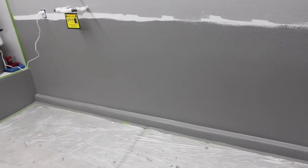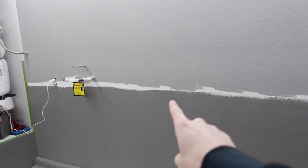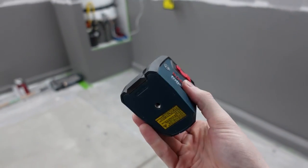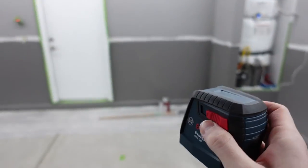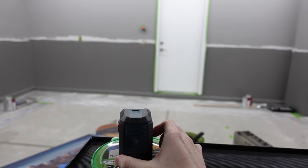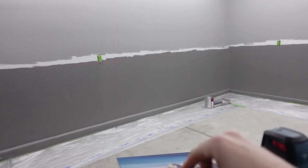It's the next day. I worked into the wee hours of the morning painting the garage — it was just too late to finish filming and do all the taping for the stripe. I've noticed that most garages slant downward toward the driveway, so if you want a perfectly level line across the wall you need to use a laser-guided leveling system. Get yourself one of these — it's about $35 — turn it on and it puts a laser on the wall. It's self-leveling, so just find a common place to put it, rotate it as you go around the garage, and you'll have a perfectly straight and level line all the way across to start taping.